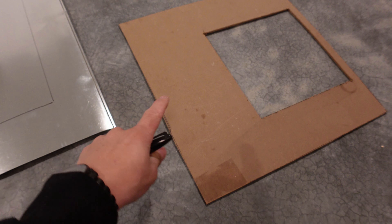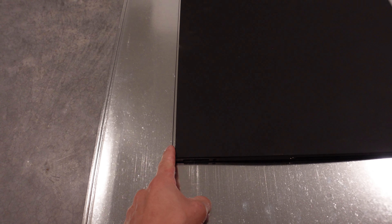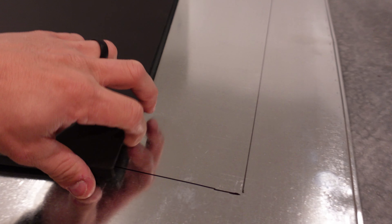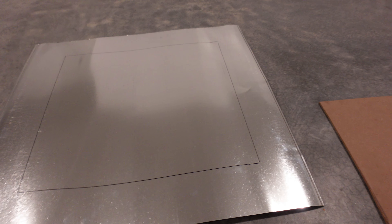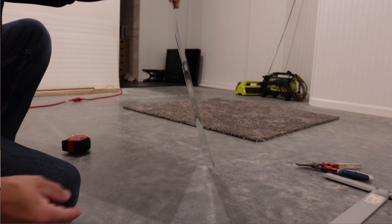I have a square marked out on the ground and I flattened out the sheet metal. I put it in the center, marked one side, then measured how high the lip was — it's three-eighths of an inch on each side. So I added three-quarters of an inch to one side. One side has a tab I need to notch out, but the opposite side has nothing, so I only added an extra three-eighths of an inch front to back. I'll take a razor knife and a straight edge to cut grooves down the sides rather than tin snips, which would leave a frilly, kinked edge.